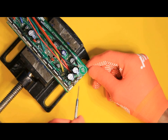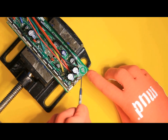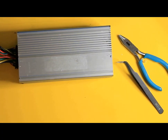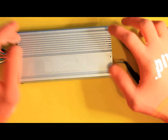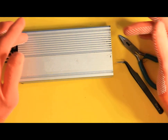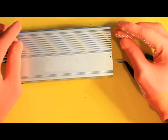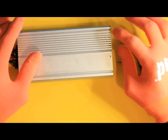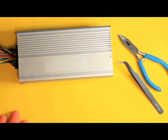That's essentially it. I just need to let it cool off, then I can stick it back into the case. All we did was take the shunts and solder them together so more current flows to the MOSFETs. I hope that was informative — just be careful not to touch the capacitors inside with your bare hands. You can solder the two shunts together or bend them, but try not to bend anything too much on that board because you can easily crack it. That's all I have — have a good night, bye.